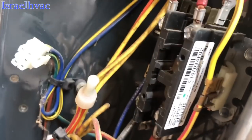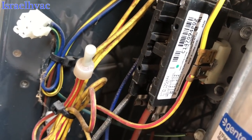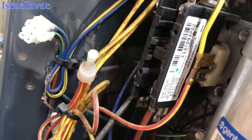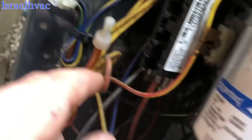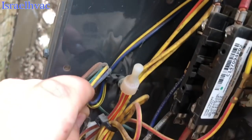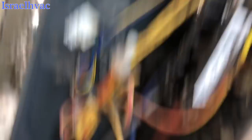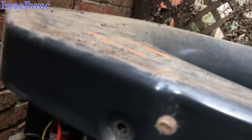On the 15i's, there's no board — no communicating board. So it is a 24-volt AC motor. It's not a DC volt motor for low voltage. Because that's low voltage — that's the plug for the motor. It gets it off the contactor coil because there is no board. I don't know why the tech support guy told me that.